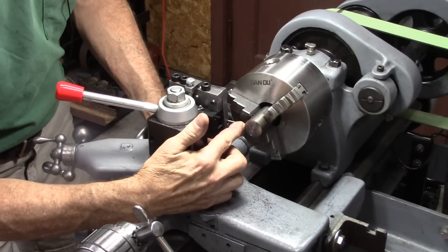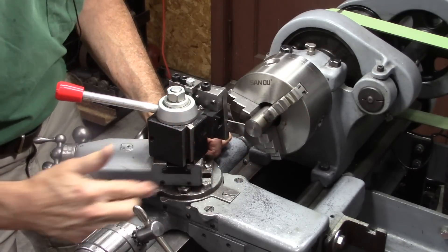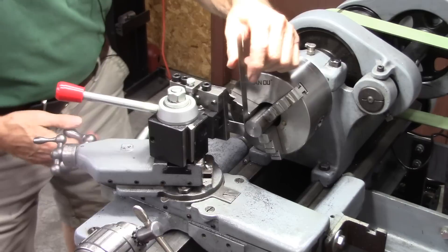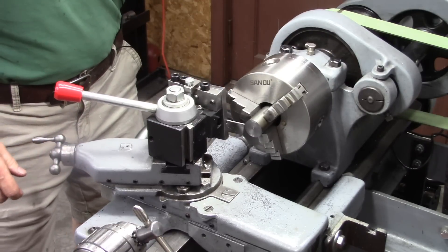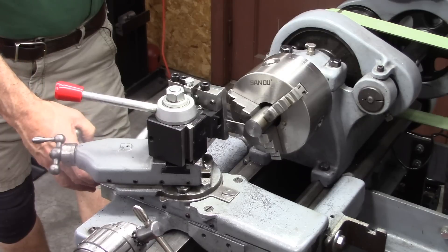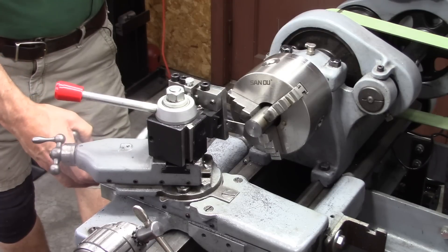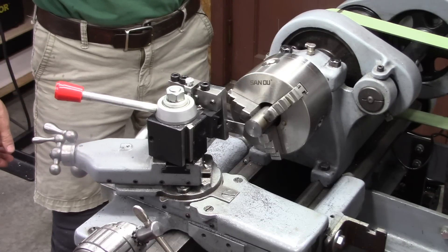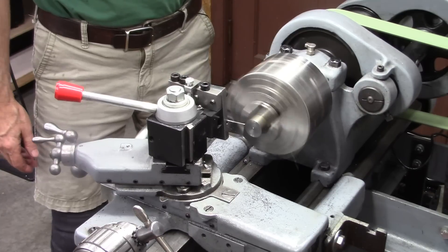This angle right here is about five degrees. I'm set pretty much on center, and my feed rate is two thousandths per revolution, which is a fairly fast feed rate, but it seems to work really good. It's one-inch stock and the surface speed is a little bit fast. Let's give it a go.